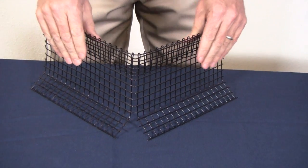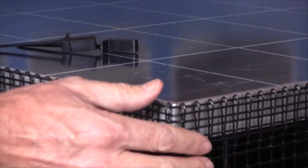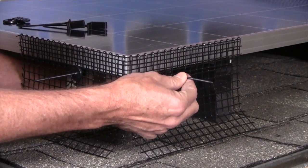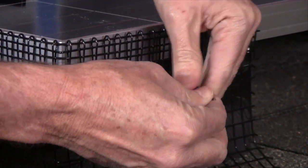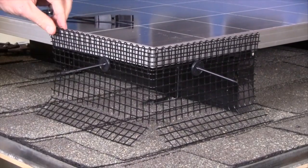These corners can be made in advance on the ground. Put the corner in place and form it to fit well. With the part in place, slide the clips in from behind. Make sure the serrated post comes through the mesh just below the edge of the frame. Each corner should have two clips on each side. Slide the lock washers down the clips closest to the corner and lock in place, leaving the others for the next piece of mesh.